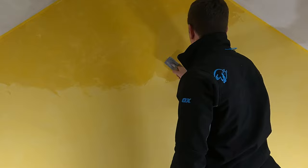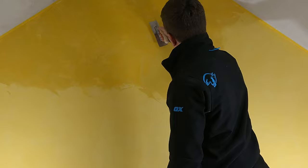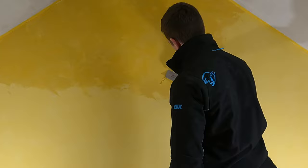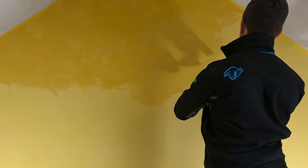I've come back one day later. I've masked and taped the edges, and now it's the important part — the top coat. This is the most important part of Venetian plastering; the other two coats you can get away with more easily. Just to clarify the coat system: the first coat is standard Venetian plaster with no color, the second coat is your first coat of color, and this is the top coat. You still apply the plaster the same way — little swirls, lots of movement, different textures.